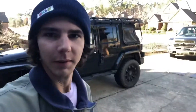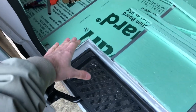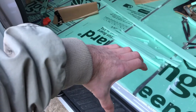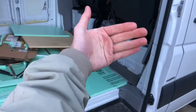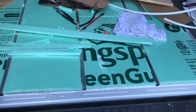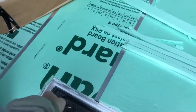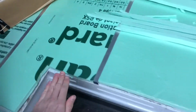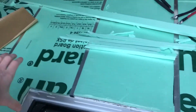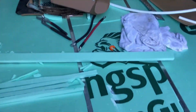I'm going to build out this area so my cabinets and countertop could come out, and my little table will flip up so when the seat is swiveled the table will sit upright. I think I can just put that subfloor in here and it'll fit this little cavity neatly. I'll build a little platform out of plywood that'll be flush, and then when I put my wood floors in it'll all be even and tie everything together. That's the plan.